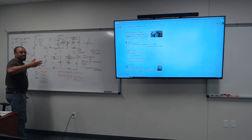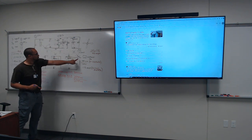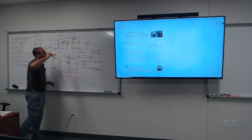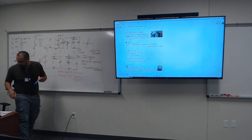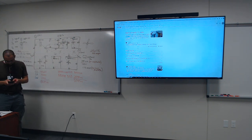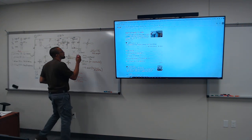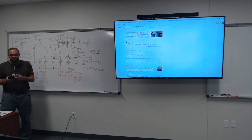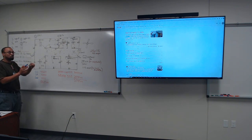So we're gonna add it in. We're gonna do our calculation. All right. So we got 1, 2, 3, 4. We're gonna put that 5. Okay. We was at 7.5. Mr. Ethan said 7.5. So that's 7.5 amps. 75 watts divided by 120. Can somebody figure that out for me? 75 watts. 0.625. Thank you. All right, so that's 0.625. I'm not gonna write it on the board. 0.625 plus 7.5 gives us what? 8.125.